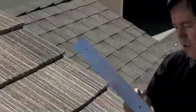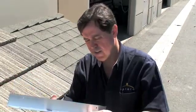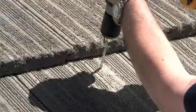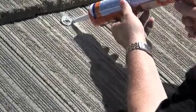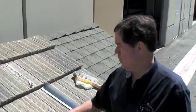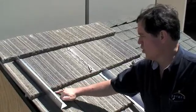Make these holes a little bit larger. If your holes come off center a bit from where you've marked, you can easily make adjustments prior to the adhesive drying. In the kit you'll find two different length fasteners: two fasteners that are three inches long and two that are four inches long. The four-inch fasteners go on the bottom portion of the tile because you have two layers of tile to go through, and the three-inch fasteners go in the back location.